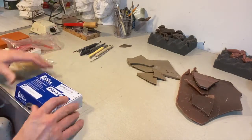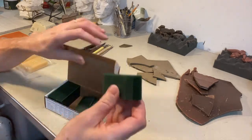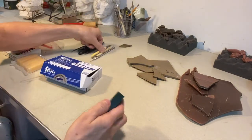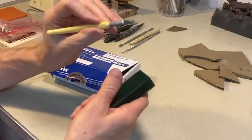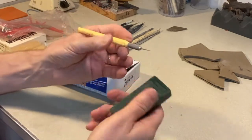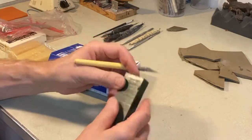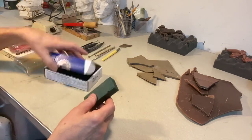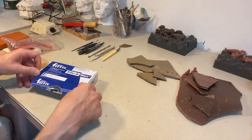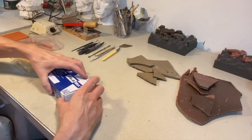Another type of wax is even harder yet. It comes in a couple different sizes of blocks — it's very hard and you can carve into it. With just an irregularly shaped X-Acto blade you can carve and shape it. Instead of trying to model it with your hands, you just carve into it, cut or saw a chunk off. It's referred to as file wax — you can use little files on it to shape and carve it, and you can also use it with a soldering iron as well.